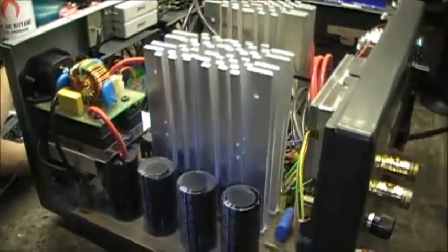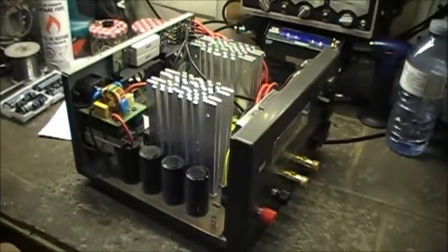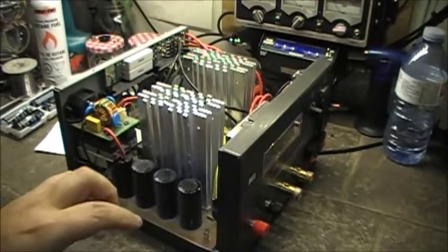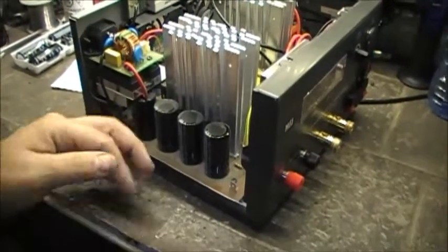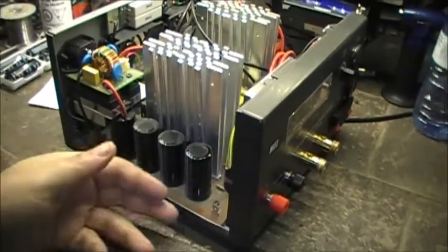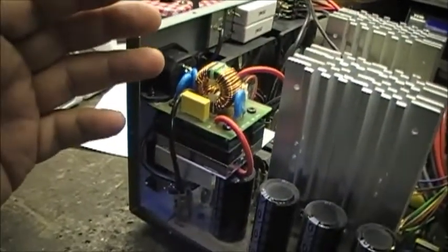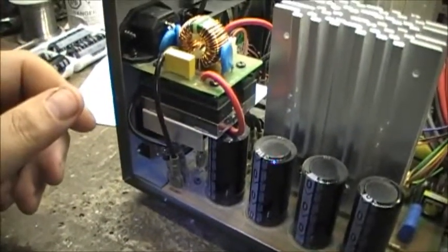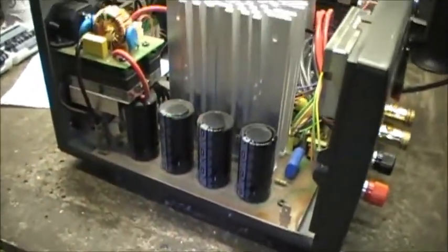The fun part with this thing is getting it apart, because I don't need to take the whole circuit board completely out. Basically what I'm going to do is take the board and see if I can slide it in this direction enough to get to the bottom of these guys to unsolder them. To even get that far, I'll have to remove the two screws in the AC section here and pull this thing out somewhat. I'll also have to remove this black wire, and with that removed it should give me enough room to slide the circuit board in that direction. That's the plan, anyway.